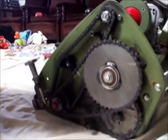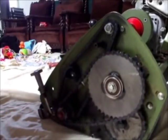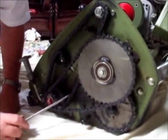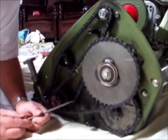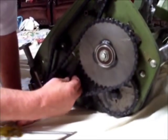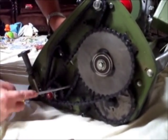Now we have to remove the chains from the cutter sprocket. This is the main drive sprocket which operates the cutting assembly and has two chains. Down here we have a removable link which we have to remove — quite easy with a screwdriver, just a matter of giving it a bit of a tap and it will come off like so. We then remove the link from the back of it, take off the front plate, and out comes the link.